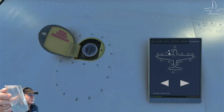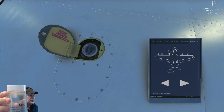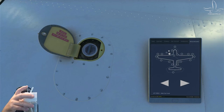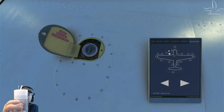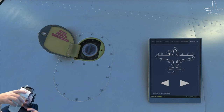Now, this is a GATS jar. For those who haven't seen me use one of these before, this is what's called the GATS jar. All the flight schools have them now. This is made so that when you push this stainless steel into the area where you're pulling fuel, it'll flow down that stainless steel pin into this hole, which goes straight through into this container. And you're inspecting it, and then you're actually going to pour it out. And if you'll notice, it has a screen in there. You pour it out with the screen, so you're screening any sediment from going back in. And if there's water, you would just pour the fuel until you get to the point where the water's going to come out, and just leave the water in here and dump it.